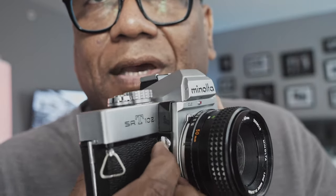So when you go to rewind the film that's in the camera, of course, pretty standard stuff. You hit the film rewind release lever, and then you pop out the dial here. But what I want to point out here, so now I'm actively able to rewind the film, but if my finger were to slip off, and I love this feature on this camera, not a lot of cameras have it, finger slips off, you see it doesn't ratchet back into the film can. The film can doesn't pull this lever back. It just maintains its position, and you see that? That's just great engineering. I just love that.